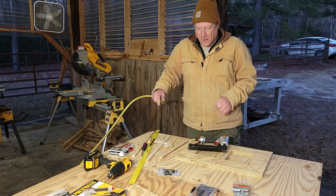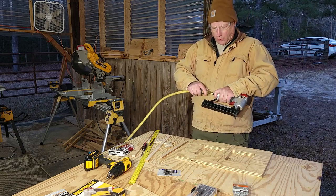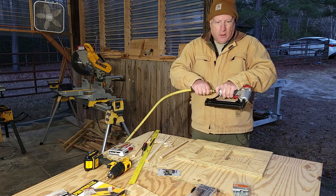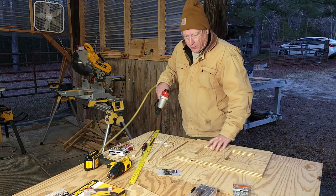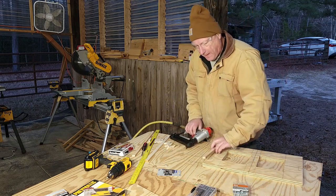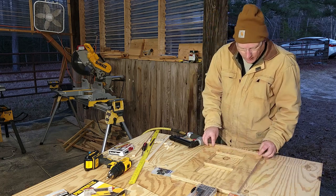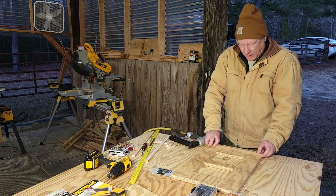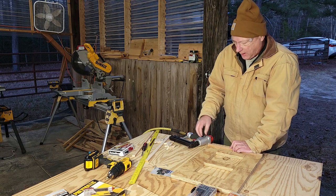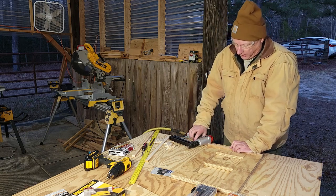Again, I'll have a slide that shows most of my power tools that I use and all my hand tools. All right, so again, I'm connecting this away from my body. It's now connected. This is now going to be the front of my Snelgrove board, so I'm going to turn this around so I get a little more access to it. I'm going to make sure the edges are flush, and I'm going to come in about an inch from each end of the rail, and I'm going to nail it at an angle to the board.